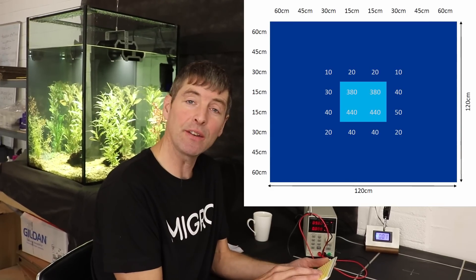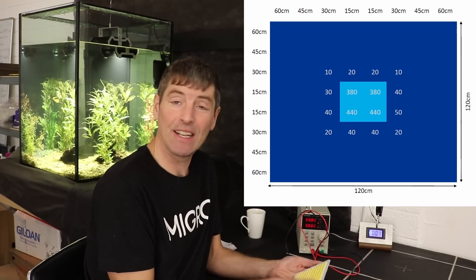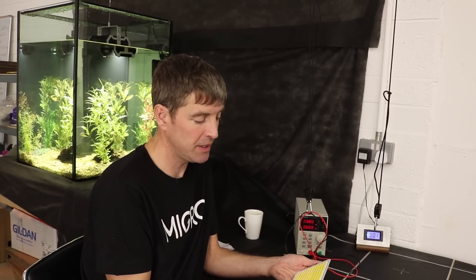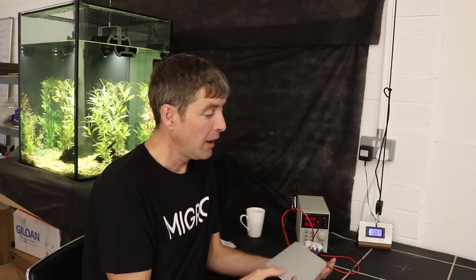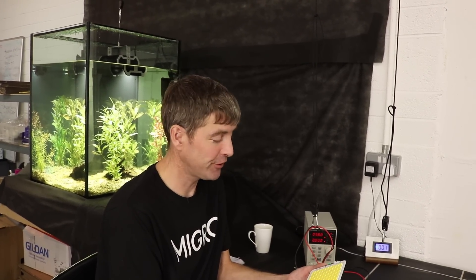The only downside is because you have to run it at these lower wattages, if you wanted to really illuminate a two-by-two properly you would need at least four of these, running about 115 watts total. You add it all together — about 10 euros each for four COB LEDs is 40 euros, another 40 euros for your driver and other bits and pieces, wires, soldering, hanging and fixing. You'd be the guts of 90 to 100 euros when you've got it together, plus your own time. For very little lower efficiency, you could be buying the 100 watt Mars reflector pre-made for about the same, so it's questionable as to whether it's worth DIY.